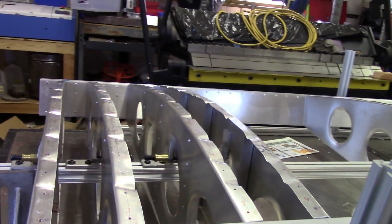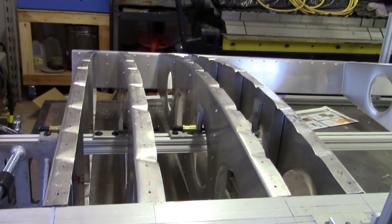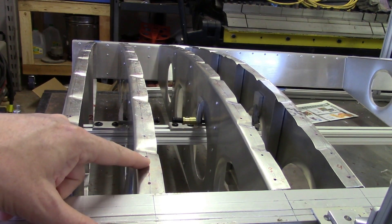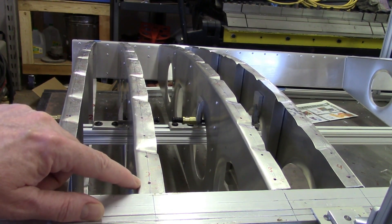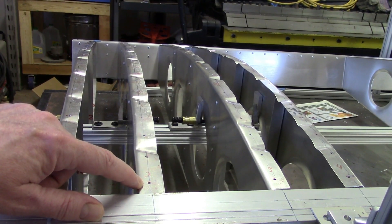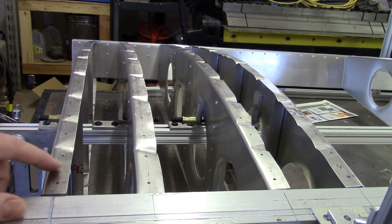On the whole, they came out pretty good. Looking down here, we can see the center line I was shooting for, and on most of these we came out pretty good. I did have a few that were right on the edge. Six millimeters is the closest that you want to have a rivet hole to an edge for an A5 rivet. I had a couple that were just right on the line, but for the most part, everything came out pretty good.